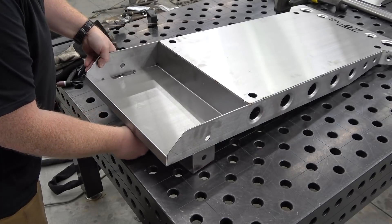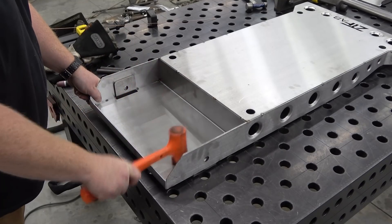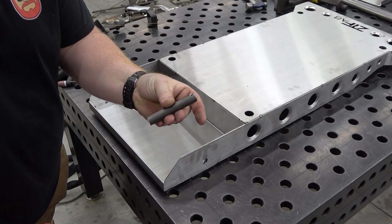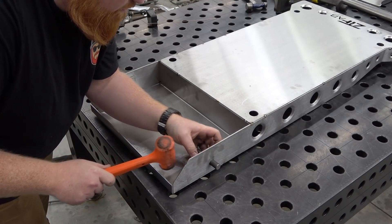With the bottle base tacked in, I can tack the axle bracket into place. The quality of the material really sets ZT Fab in front of the competition. No other carts I've seen on the market use a quarter inch thick axle brace — that really beefs up these carts. You can use the wheel axles to align the axle bracket to the base.